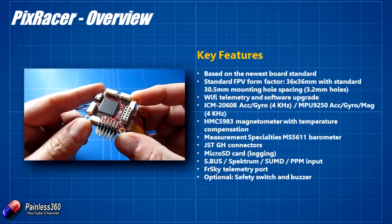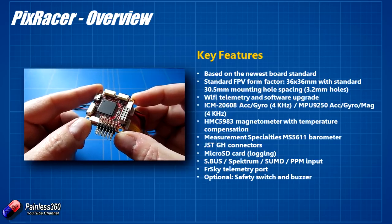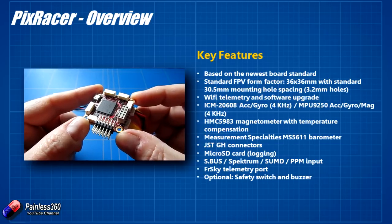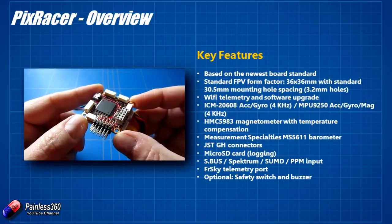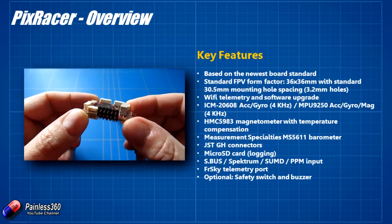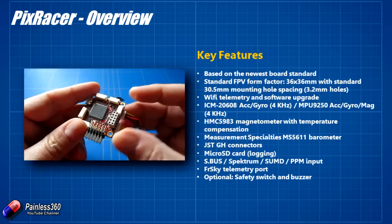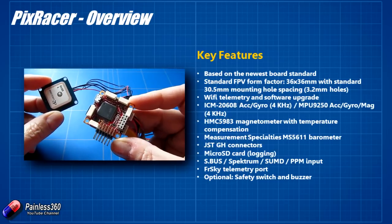They have sacrificed and removed some of the IO buffering that was on the larger boards, which was there for safety when flying big craft. So the inputs from things like the remote control receiver are much, much faster, and with sampling rates increased to 4K and some other improvements, it's a much more capable board for racing as well. For those of us that have wanted a board that can do GPS as well as fly a little racing quad, this is an option.